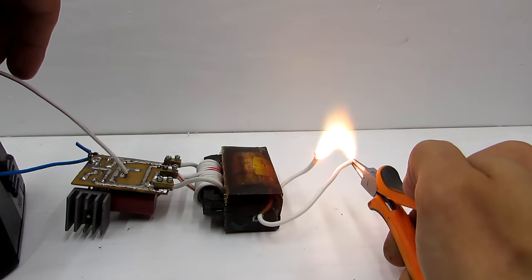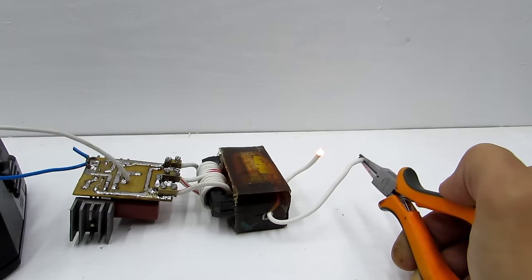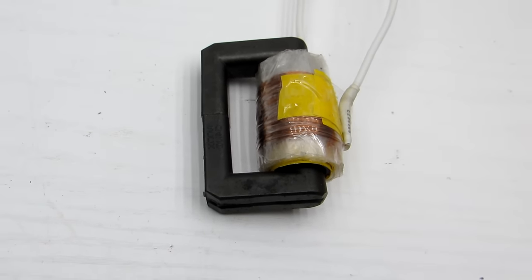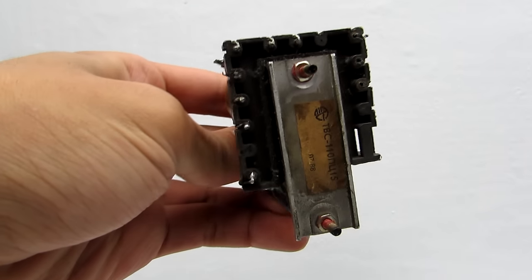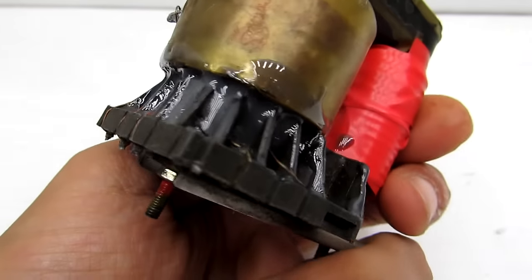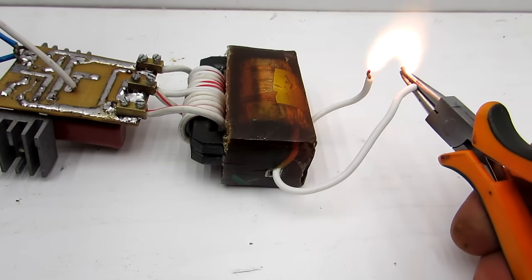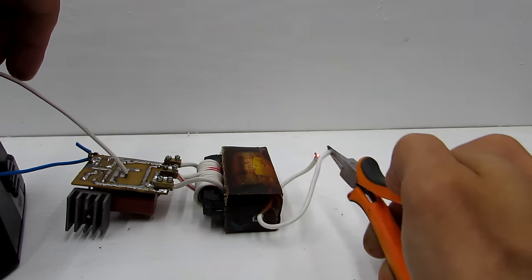Simple but powerful high voltage generator can be constructed on the basis of this driver and the TV flyback transformer. At the free part of the core, do 2 by 5 or 2 by 6 turns of wire with a diameter of 0.8 mm. I advise to use stranded copper wire with silicone insulation. If you use a flyback transformer from an old TV, be sure to fill additional resin on high voltage winding, otherwise the transformer will burn.